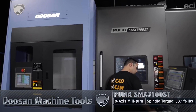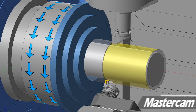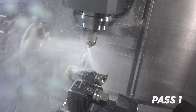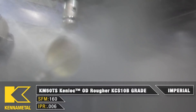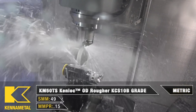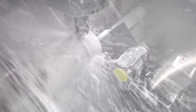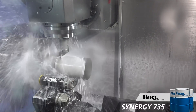This is especially true when turning on a lathe. I've seen on numerous occasions someone turning a part from a super alloy like Inconel, and the inserts were breaking down sooner than they expected, so they adjusted the feed rate slower and slower each time they had to change the insert, not realizing this was having a small impact on their tool life and may have actually been making it worse. The first thing they should have adjusted is the surface footage. By keeping the surface footage the same and decreasing the feed rate, they were cutting less, which in their minds is exactly what they wanted to do. But what they didn't realize is the slower they made the feed rate while keeping the surface footage the same, the more the tool was rubbing. Lowering the surface footage instead will increase the tool pressure, which would allow the tip of the insert to stay engaged in the cut rather than rubbing the material away, and it would also reduce the heat buildup from the higher RPMs that ultimately breaks down the cutting edge. This would have a much greater impact on tool life than lowering the feed rate first.